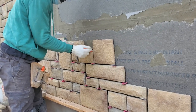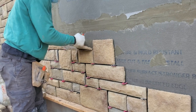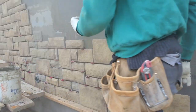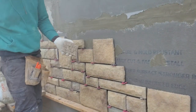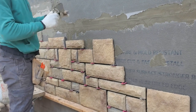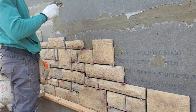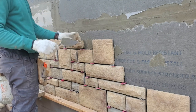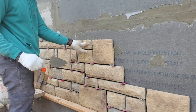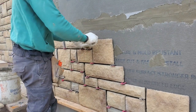Now we just need to make a mark — line it up with the previous one and leave your three-eighths inch joint, then cut this off. To cut this stone you can use an angle grinder, a skill saw, or a concrete saw. You can rent one from your local hardware store if you don't own one.